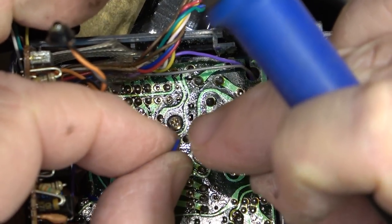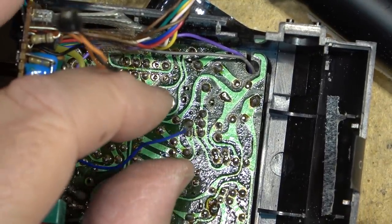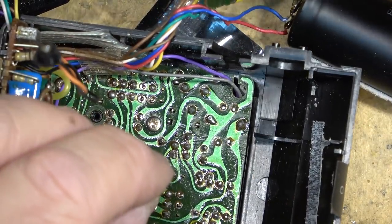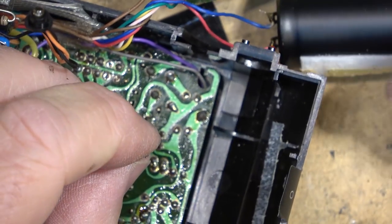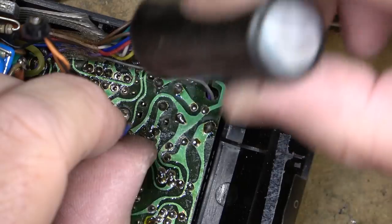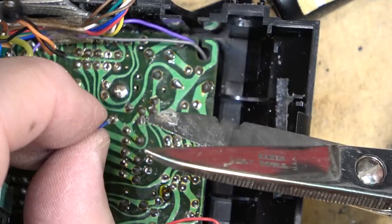So what we saw here wasn't a full discharge. That cap there holds a hell of a lot of energy. The ones that the idiots I went to school with were playing around with were just little tiny caps, maybe 10 microfarads at 350 volts or so, or 450 volts. This one here is more than likely 100 microfarad, maybe. I don't know. It doesn't say. It just has a number on it. It does not tell you how many microfarads this thing is, but it's got a fair kick.